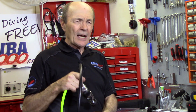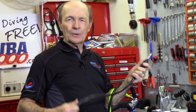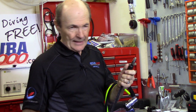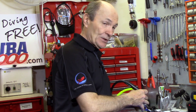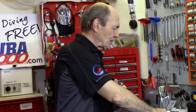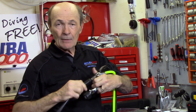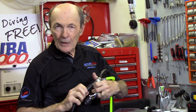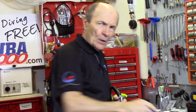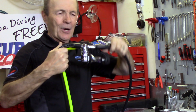What about your BC? Suppose you decide to buy an Oceanic BC or some other brand — it doesn't matter. You get the low-pressure hose for the Oceanic — here it is right here. Once again, you go to the first stage, take out one of the ports with the 5/32nd Allen key, put your BC hose into the thread, and it threads right in. All low-pressure hoses — whether it's an inflator hose or a second-stage hose — are the same. Nine-sixteenths, snug it up.